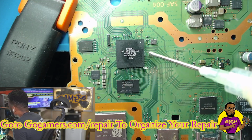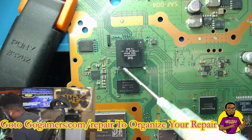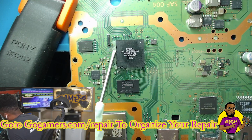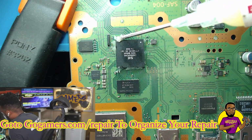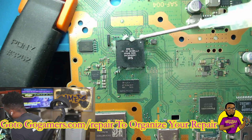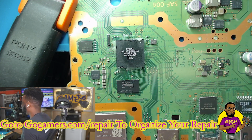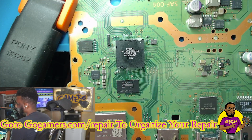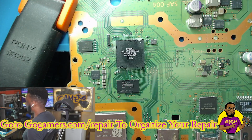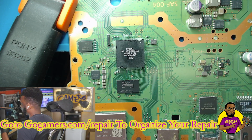Now, I already have another chip pulled off another board, because typically when I scrap boards, I'll try to pull off whatever chips are good. Hopefully that chip is good. If it's not, then I'll have to order one. Whatever the case, if you have an eBay account, I recommend getting a chip that is already reballed, because the reball process is the most complicated process here. So hopefully the other Southbridge does work, or hopefully I don't mess up the reball process and we can get that one put on.